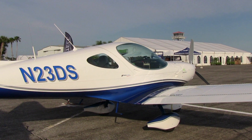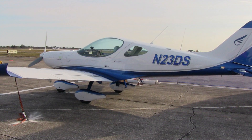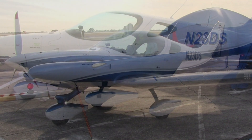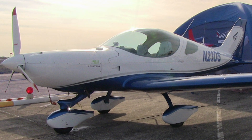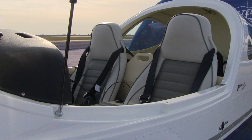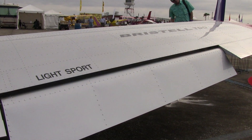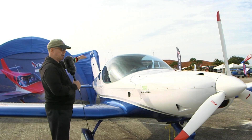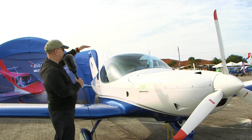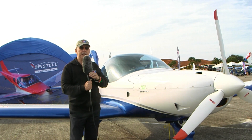Let's look at the basic construction first. Like all these airplanes, there are composites for shapes like the cowling, where composites work best. However, an awful lot of this is an all-metal, riveted design — but a very nice job of riveting. These are pulled rivets, but they are so nicely achieved they look like bucked rivets. That's carried all the way through. There's another change I think is significant: over this smooth canopy, as it tapers down to the aft fuselage, that transition is now nice and smooth. In the earlier ones there was kind of an abrupt finish, and maybe that's not an aerodynamics issue, but it is a visual one.